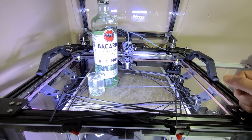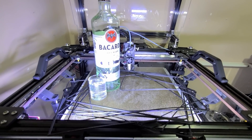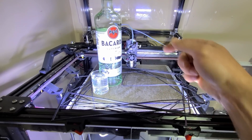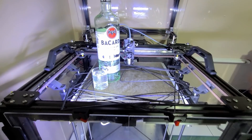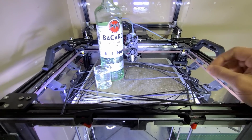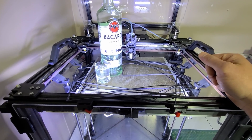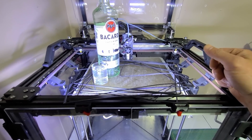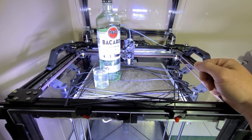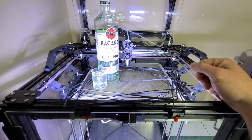While this sounds stupid for a lot of people — and even me included, I admit this is stupid — it has helped me to understand the limits of almost everything: the hotend, the extruder, the motors, even the 3D printer board. Step rate, or step pulse — the number of steps that a 3D printer board can send to steppers, or in my case an ODrive controller — that is the limit I was not aware of. I've hit that limit, hit the wall, and it has been a great learning experience.